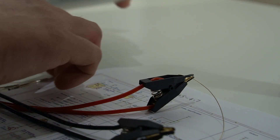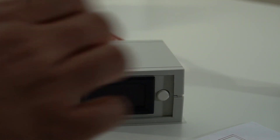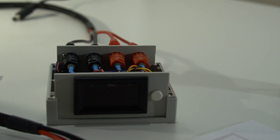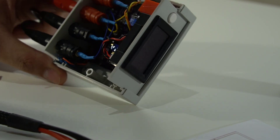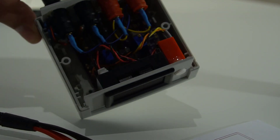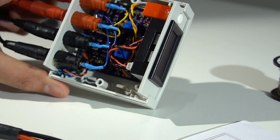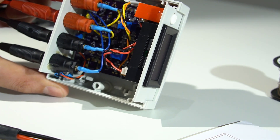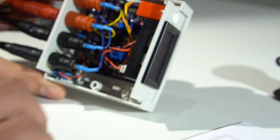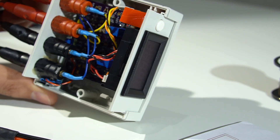If I power this thing off you can see what's inside it. I've actually not glued anything in place just yet, so the circuit board is just kind of hanging there. But it all fits really nicely. Most of the space at the top is taken up by the connectors. I used slightly larger banana sockets than I really needed — these are 24 amp ones. That's totally overkill but that's all I had. And the DC input is 5.0 volts.